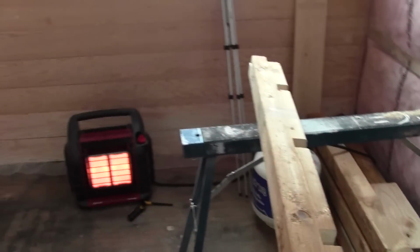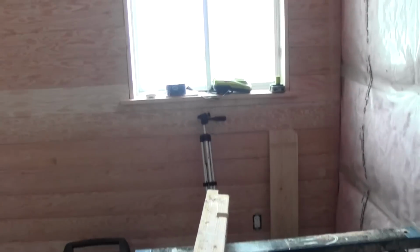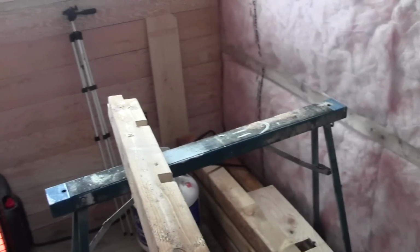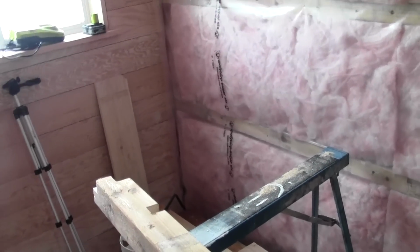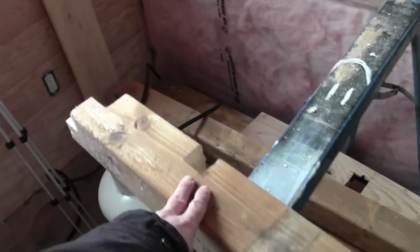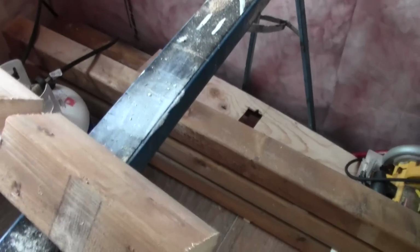And then I started to cut the 2 beams for this. And I cut out the flanges right, or the half laps on the top and the bottom right. But then, just because it was approaching time that I had to leave, I forgot to flip the beam when I cut in my mortises for the shelves that are going to go back. So these should be sitting this way.